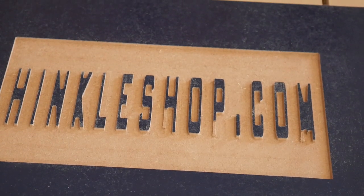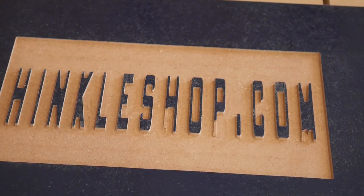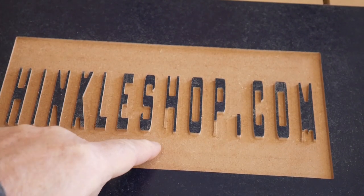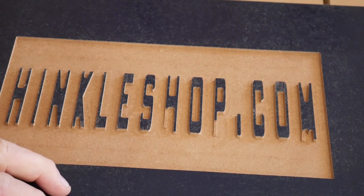You know the golden rule of the Hinkle shop — when Verna makes a mistake, he shows you the mistake. The mistake I made was I put an upcut bit in that mill and not a downcut bit. When you do these letters, I highly recommend you use a downcut bit so that it protects the letters and doesn't lift them out. Now we got a couple of boo-boos. I'm going to turn the camera around and show you. It's not catastrophic — I can fix it, I'll be able to use it. I'm not going to throw it away, but we got a couple of little pieces that got pulled out and we got some more paint. The upcut bit grabbed the MDF, which is not very strong. I highly recommend maple too if you're going to do this. Maple is a good one and so is black walnut for doing these letters.